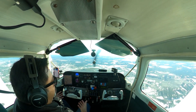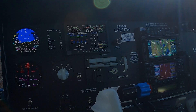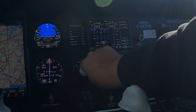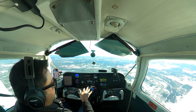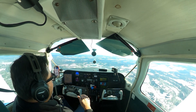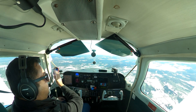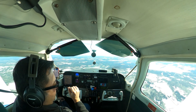It's a small thing, but anything that reduces pilot workload — especially in IMC — is a good thing. Back to the radio coupler: right now it's in heading mode, even though the GI-275 is in GPSS mode. If I switch it to nav mode I actually find it does a better job tracking the magenta line and also does a better job of leading turns and keeping me on the magenta line after a turn, whereas heading mode tends to overshoot the turn a little bit. Nav mode in combination with GPSS mode seems to be the best combination for me.